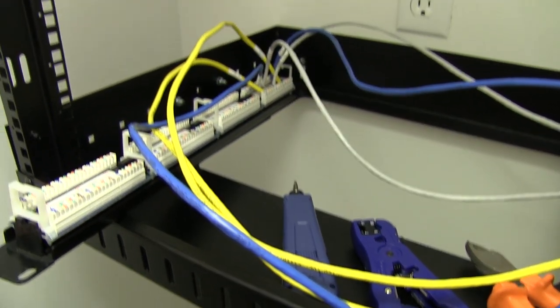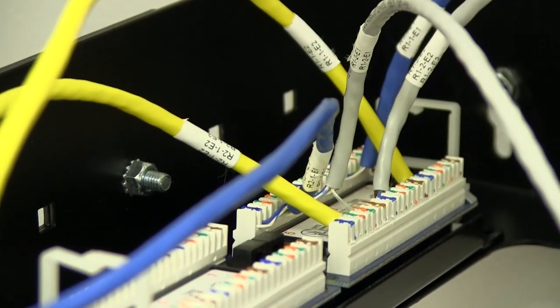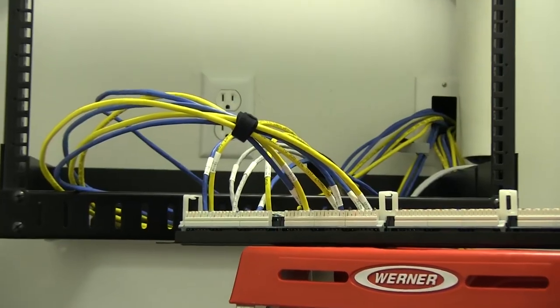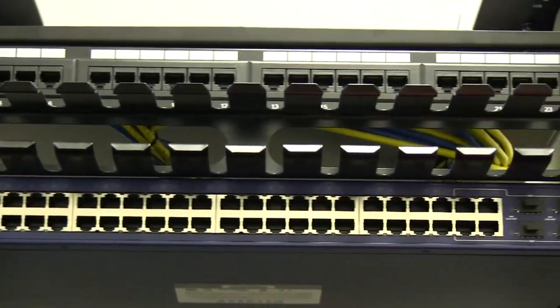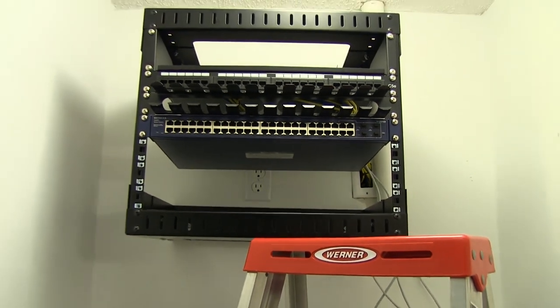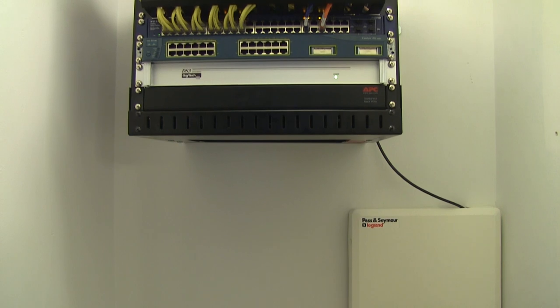Alright, next level time. For uber flexibility, use a cable managed patch panel for quick network reconfigurations, easy labeling, and of course bragging rights. Go big or go home, people. You can see I took the time to label my network cables on the back side of the patch panel too. This saves time and always helps with troubleshooting. I seriously suggest getting a cable toner if you don't already have one. It's a magic wand when it comes to tracing structured cabling. Seriously, get one. Finally, all finished up with my home comm closet project.